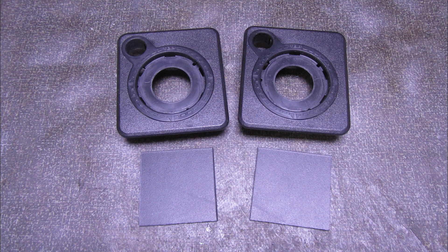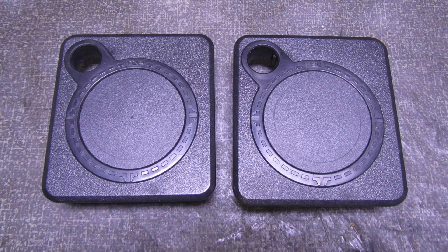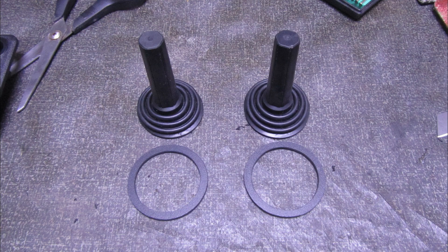I cut two squares here, and then with a compass I draw out the circumference. Generally I make it a little bit wider than needed. Then I cut out the external part and try to fit it — checking if it sits perfectly. I make it slightly tight; it can't be too much, but the ideal is to have a little bit of pressure. I confirm the contact on the sides is perfect, then I do the internal work, keeping it a little wider so it can hold firmly in place.